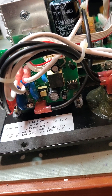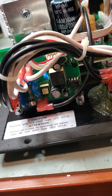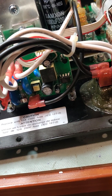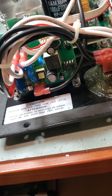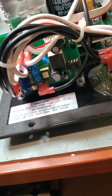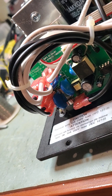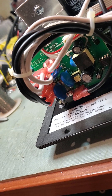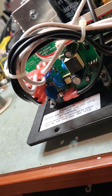The problem is when I hooked it up — even without it powered — the onboard six volts came up okay. I was scratching my head, and it turns out that just having additional capacitance on the six-volt output made the thing start working again. I started to suspect a 220 microfarad cap on top, replaced it with a 470 microfarad, and it seemed to work. So I didn't actually need to hook up an external six-volt supply.